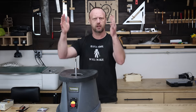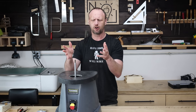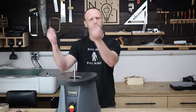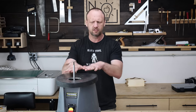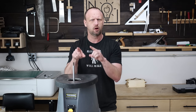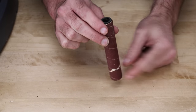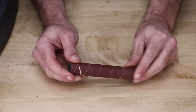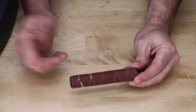Did all of these come from the same exact factory? Well, I guess I'm just going to enhance mine. So what I'm thinking is a new top — have it stick out a little bit further, squared off so I have more work surface. Now, I know somebody could argue that putting a top on it raises it up so you use less of your drum. But I'm going to make it removable, so that's fine. I also think that by having a top on it, it's actually going to make me use the drum better. Most of the wear comes on the ends of the drum, but if I raise the base up with a new top, now I'm using the middle part and getting more use out of the drum.